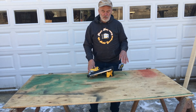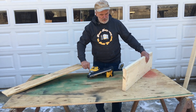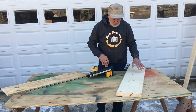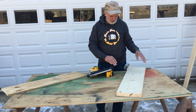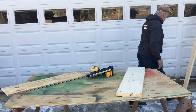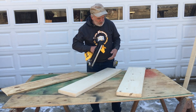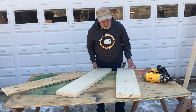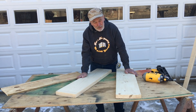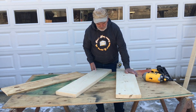We're going to build a rough opening. We'll do the header first. The rough opening is three feet wide by four feet high on these particular windows. There'll be a stud, a jack stud, or a cripple and a cripple, but we'll start with this.